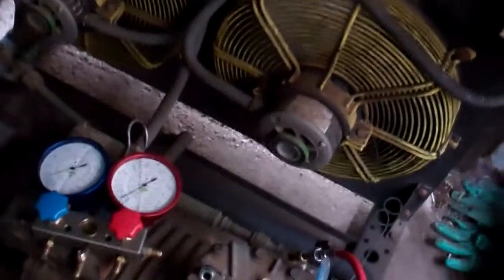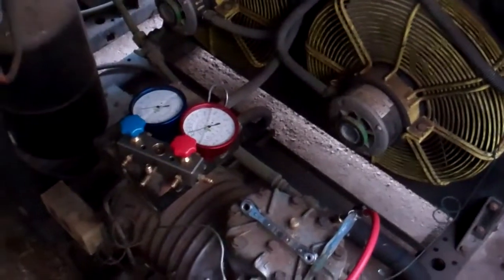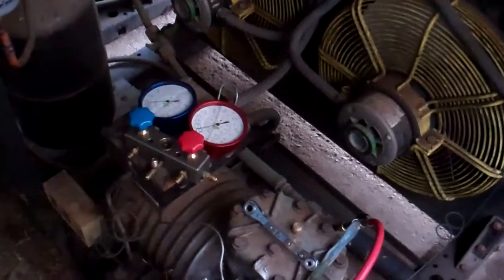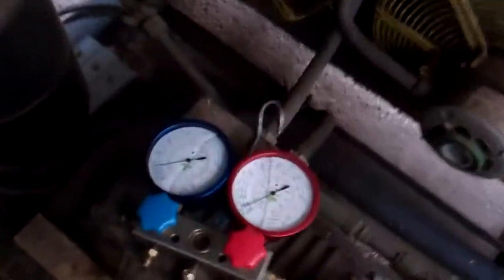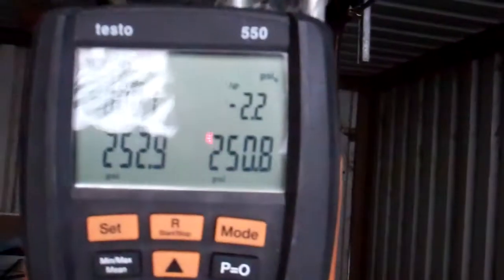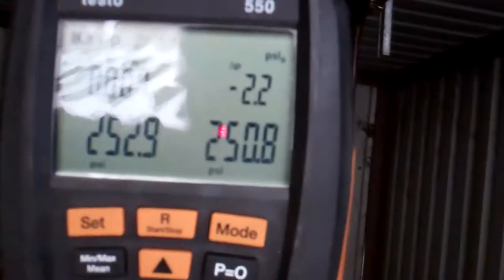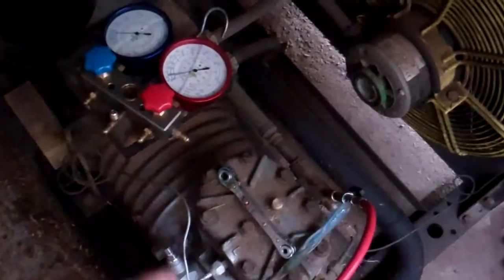I've gone all over the unit looking for it, couldn't find a thing. I was expecting it to be quite a big leak and you can hear it coming out because it had no pressure on it. Anyway, put some more nitrogen in there and then I noticed it dropped about 5 psi. So I'll test those now. I zeroed this just as I started recording so it's lost 2 psi, and I didn't have anything showing at about 150 psi. I don't really want to go much higher because the compressor bodies — it's on the suction side — they don't take too much.